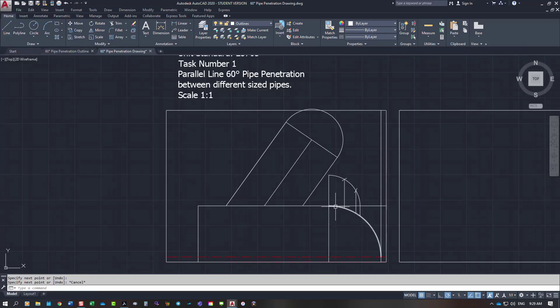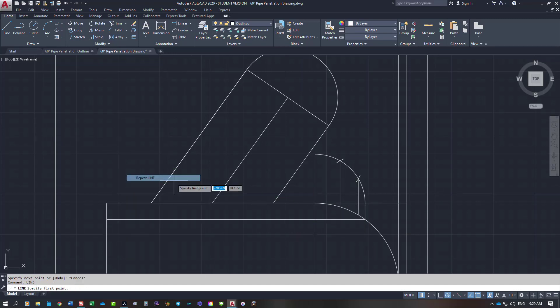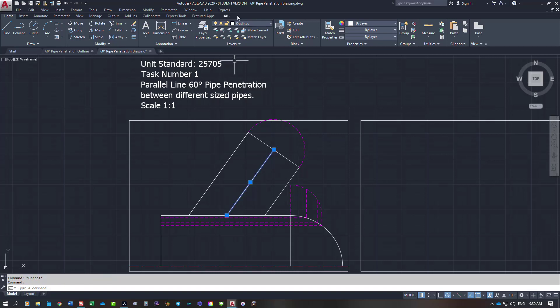This is an end view showing how far the penetrating pipe — the 120 — would come in and hit this 100-mil radius point. Once I've got those points I project them horizontally along. These are all projection lines. The top circle here also needs to be broken into equal spaces — this was a quarter circle broken into three, and this being a semi-circle we're going to break it into six equal spaces. I'll project the center line up to the top and draw my circles in from either side.